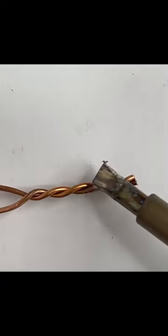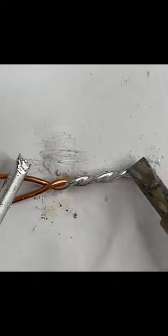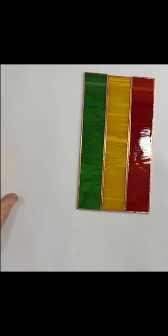As you can see here, the solder is not adhering to the copper at all — it's simply sitting on the surface. So when we apply flux, you can see the copper is immediately cleaning itself up. It's a lot brighter there, and that's getting rid of the oxidization, which allows for the solder to bond really well with the copper foil and with lead as well.